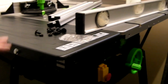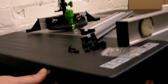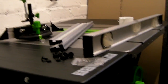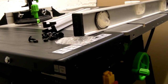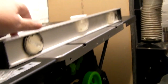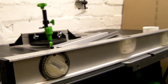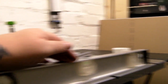I've put the two side extension tables on. It is a little bit fiddly trying to get the nuts and bolts on on either side. One way you could do it is flip it over onto its table top and then put them on that way, but there was nobody here to help me flip it back over. To check alignment I placed my spirit level across both sides all the way across — there's no gap at all underneath, and the same all the way across.